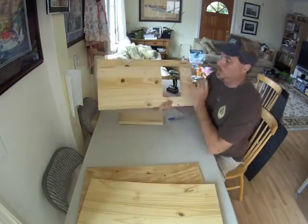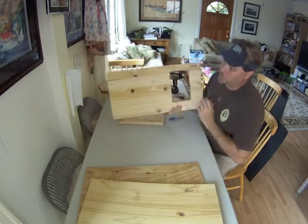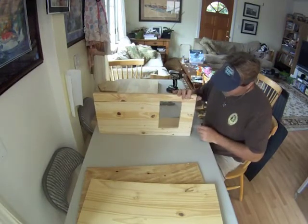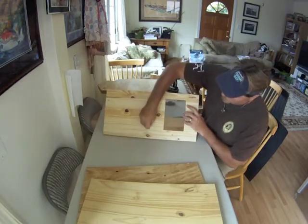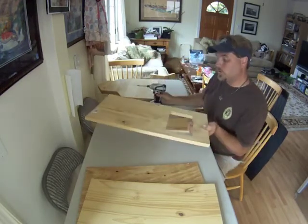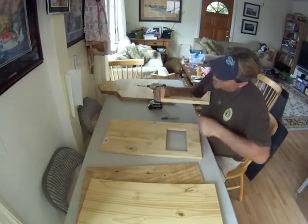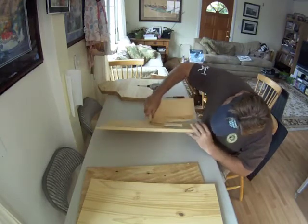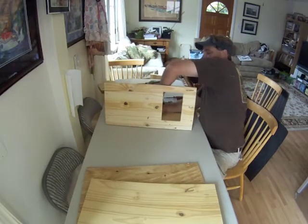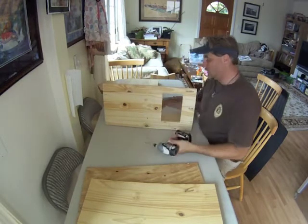Now you will find the door opening. You will notice I marked this inside with arrow A, and there is nothing on the other side — you want that to go on the outside. We have three screw holes here, here, and here that mount it together. What I am going to do is push one screw through to the point where it is just sticking out on this side. I can then drop my hole, which is already there from the pre-installation, onto that spot, hold it up, and screw it in.